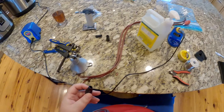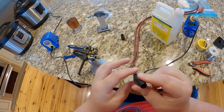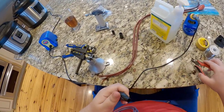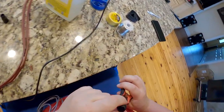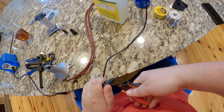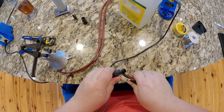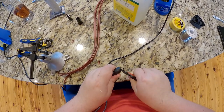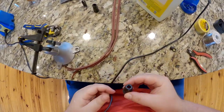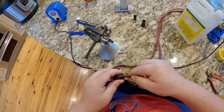I don't like using heat shrink that far up because this is where it sits and does the pressure clamping thing — there's a wall that this has to push against. It may not even be usable in all honesty because it's designed for a much smaller amount of wire. Let's cut — we're gonna go right to where these are. We're basically removing the entire rubber end, getting right to the hard plastic. So even though we cut off that much, we still have about a quarter inch that is just super tight.